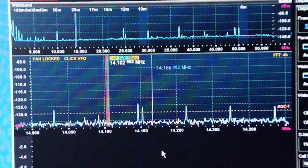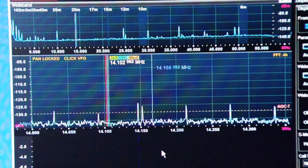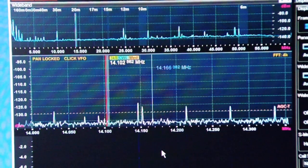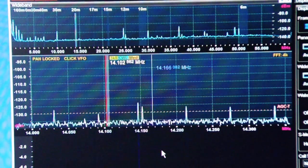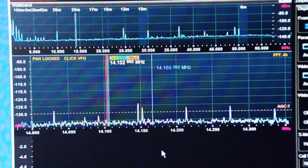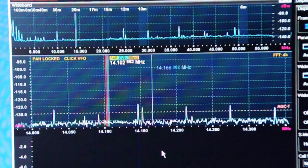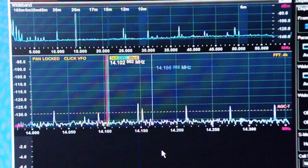This will be a measurement of common mode current, as picked up by a Pearson model 4100 current probe connected to a nano-10E software-defined radio. Right now the light is off. This baseline noise is essentially local EMI that's been picked up — it's always there. Those little spikes are fairly meaningless.